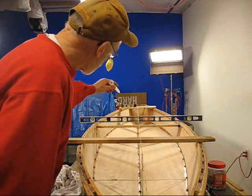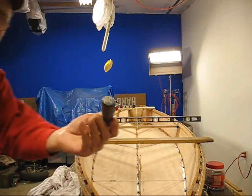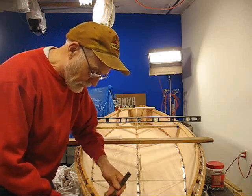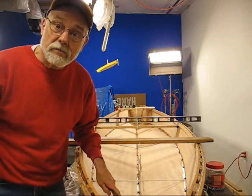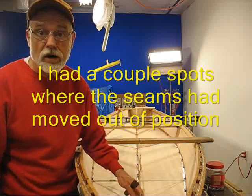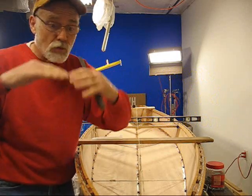The keel line is still straight. I've also taken the handle of my putty knife and gone around to where the seams are to make certain everything is still in alignment. The boat has been tied down for a while and it's easy for the panel edges to ride up over each other.